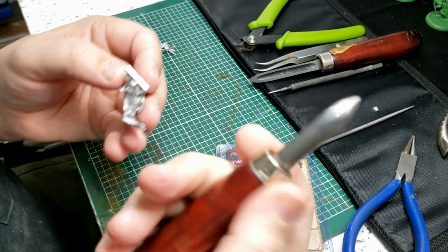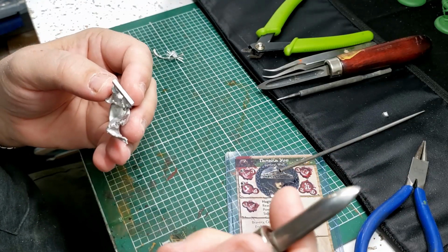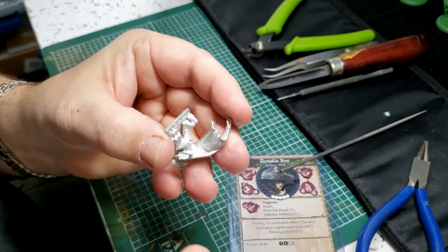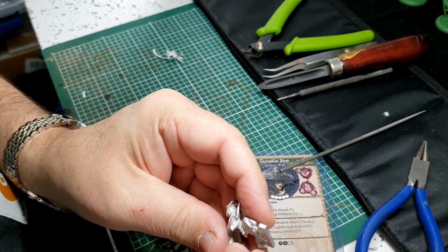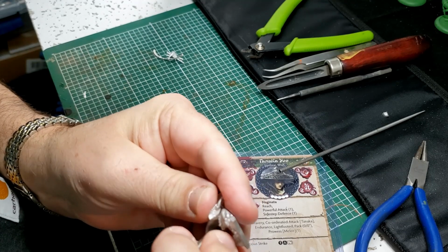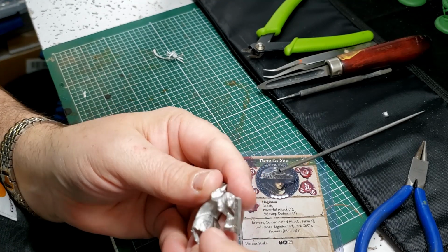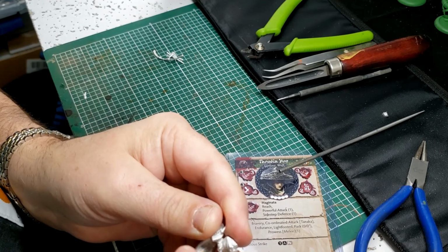Good. All right, so here's a burnishing tool. Basically, you can use it to polish. You can use it instead of a polisher for anything that's not as hard as this little bit of stainless steel. So one of the options for dealing with this would be to take the burnisher, get the tip of it in there, and with the burnishers you have to press. With the file you're just barely putting pressure on it because you don't want to remove all the metal. But with the burnisher you're actually trying to push down and smash whatever you're burnishing into what's below it.